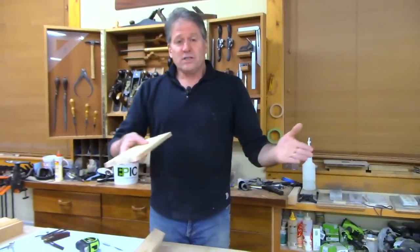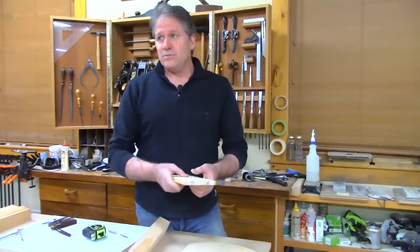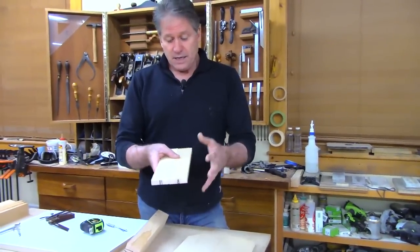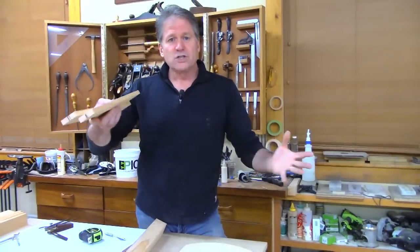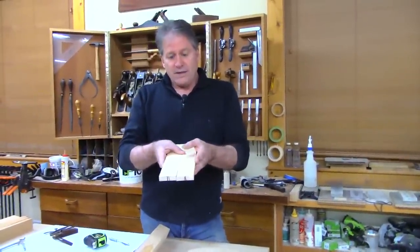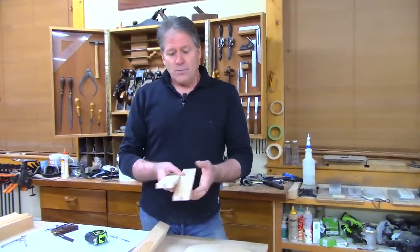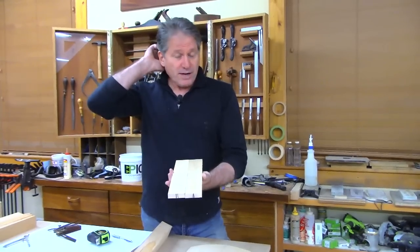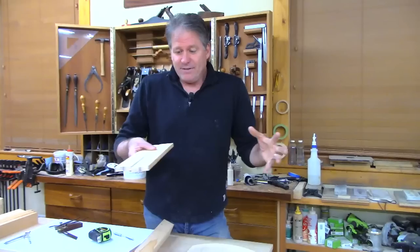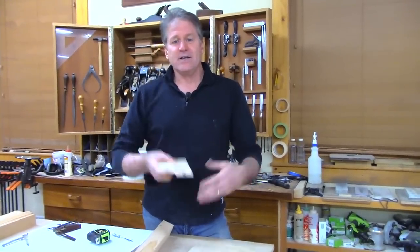With the moisture changes seasonally, like here in the summer, it's getting pretty humid now and then. It's actually beautiful here today, but we get a little humidity up here, and when you get the humidity, all the wood slowly absorbs it and just takes it in, and the fibers in the wood actually swell. Wood expands. That's why our doors are getting sticky in the summer and all that. But in the winter, everything changes. It gets super dry, all the moisture goes out, and everything dries and shrinks up. So you have this kind of accordion-like thing going on seasonally throughout the year.